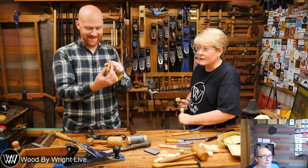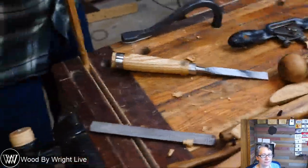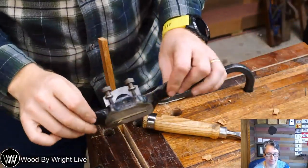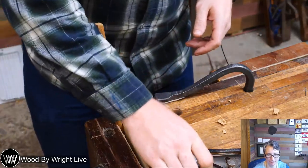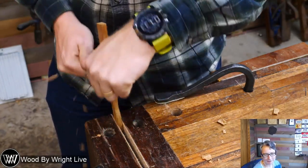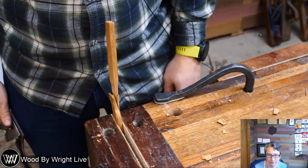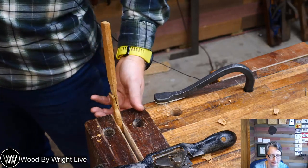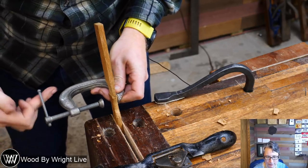Basically I want to thin out the portion of the blade near the tang. It's thin right in front of the handle because that's our thickness, and I want to thin out the rest. Rather than hitting this with a chisel — which risks catching the grain and cutting out a chunk — I'd like to bring a hand plane in, but basically a spokeshave is a hand plane with a really small sole. This will allow you to get a nice clean cut up on the surface. I broke my knife. That's what clamps are for — I'll put some super glue on it.